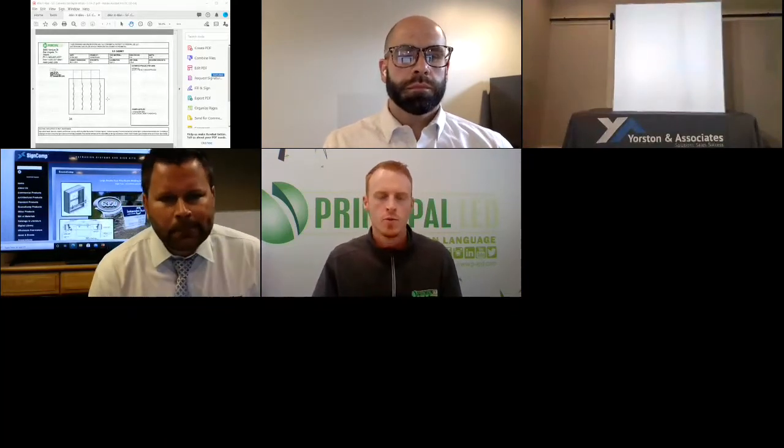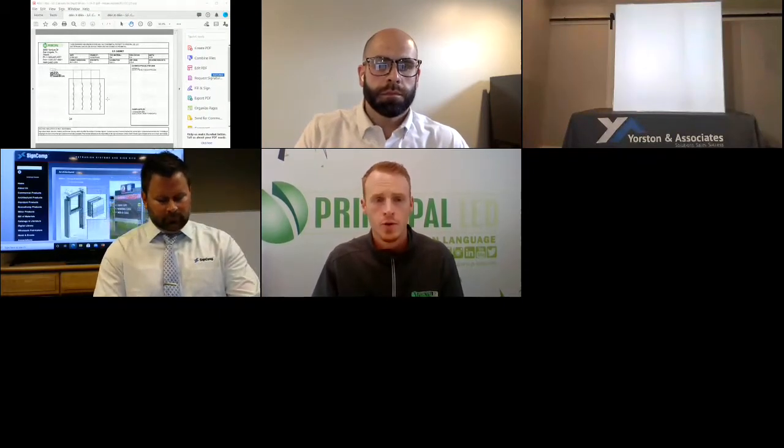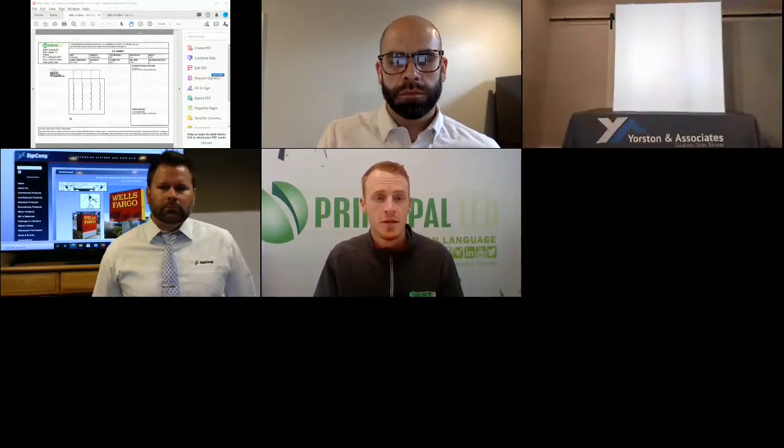Okay. So just for instance, one thing that we try to work with as far as communicating with customers is, if they ask for a layout, this would be a standard layout that we would do. And we would lay it out with four rows, 24 mods, not knowing that there's bracing and things of that nature that make a difference on the layout and could affect the outcome, which is what you see in this video from Ellen's feed, where we have a shadowing issue. Now, knowing that information up front actually helps us internally, and we can fix that layout and get you set up with the actual row spacing you'll need in order to get that to light without any of that shadowing issue, which is the second layout that Lauren is going to pull up.